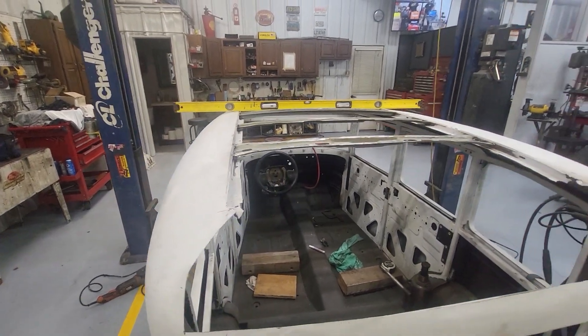There's nothing ever truly perfect on these 1930s vintage cars in terms of squareness. This roof came off of a 2017-2018 Suburban — we just cut along a roof rail and I trimmed off the edges. I identified and cut off the front section — this is the front. The 14 and 7/8 inches of waist is sitting over there, and that piece will get married to this piece. I'm landing on one of these braces — somewhere midway on that brace.